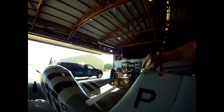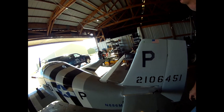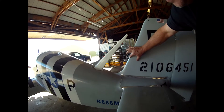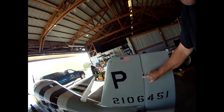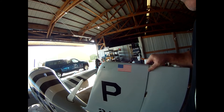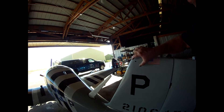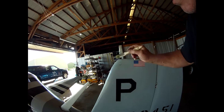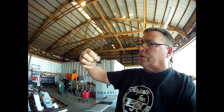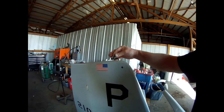My vertical fin here is a little different than the KR2 plans. I actually have three pieces of three-ply plywood glued together, about three inches wide, coming all the way up and ending in the rudder post. There's a slot cut in the rudder post with that plywood piece slid in and glued. I drilled a quarter-inch hole here to retain this thing — I'm about halfway through that three-inch piece. I made this roll pin welded to a quarter-inch bolt welded to a washer, and that's actually going to become part of this piece and sit right here.